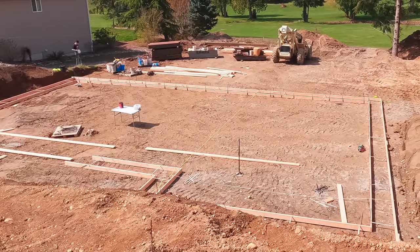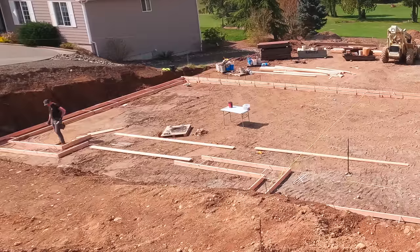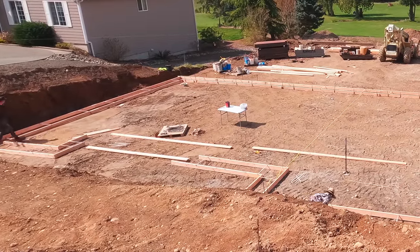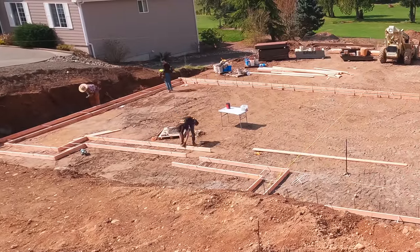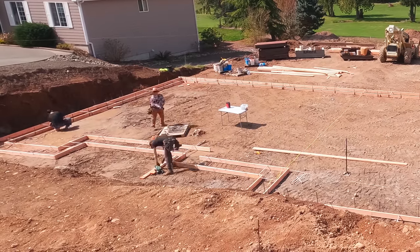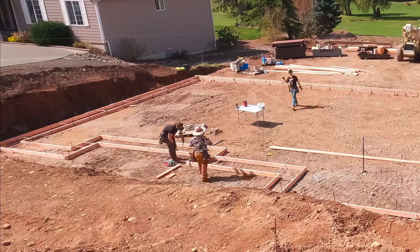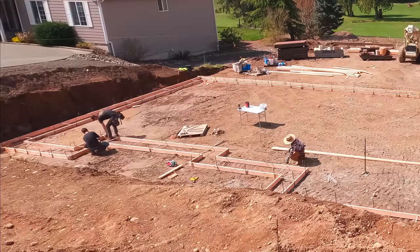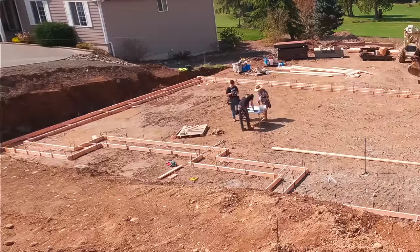Now that everything is square and it's parallel along the perimeter, now we like to fill in all of the jogs in the front. These are the pieces that Noah had pre-cut for us, and that's going to help us to go a whole lot faster. So at this point, it's just connecting pieces up and pulling parallel. Any front to back walls, pull off of that right-hand wall, and any walls that go left or right, pull off of the back wall for parallel. I'll get into it in more detail in the next video when we start tying steel, but the foundation walls do not sit centered on these footings. And I'll explain that in more detail then. If I try now, frankly, I'm just going to confuse myself.